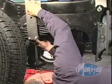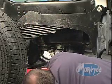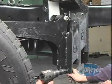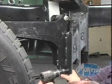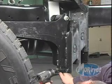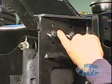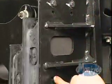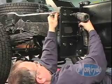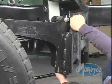With the installation tool or port-a-power removed, the axle supported by the floor jack, and the frame firmly supported by the safety stand, the rubber shear spring should be completely relaxed. You can now begin removing the 3/8 inch nuts and bolts securing the rubber shear spring to the spring carrier and the frame hanger. Be sure to note the holes that the rubber spring assembly is bolted into for reinstallation. After you've removed the eight bolts, you can slide the defective rubber shear spring out of position.